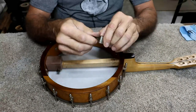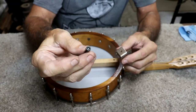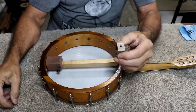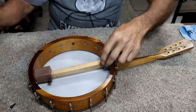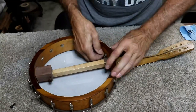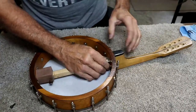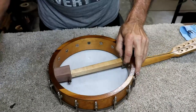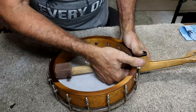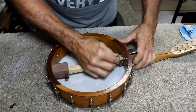I had to find a screw for this, so I found a hex screw. You might say you'd rather have a regular or Phillips screw, but there's a reason I specifically chose this — these are hardened and it won't strip as easily as other types. This goes down on here like so, and I made a special pin for this — the pin goes through there through those slots. It worked perfectly off camera, and now on camera there it goes, it's going through — there it is. You can see the pin is through on both sides. I made this little piece of metal — the one thing I haven't tried yet — and unfortunately right now it's not fitting. I really thought I had it sized where it would fit.